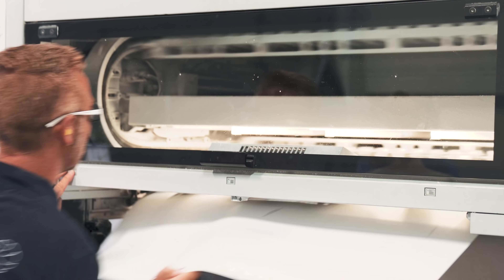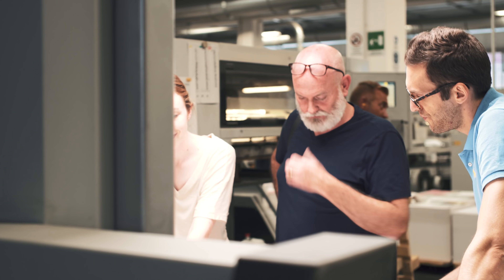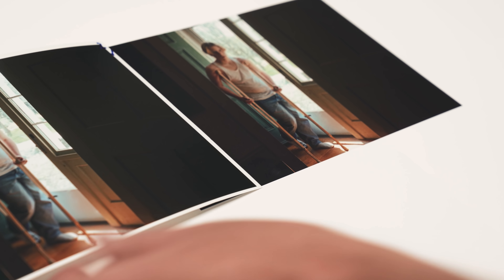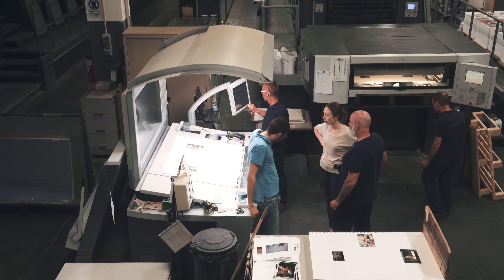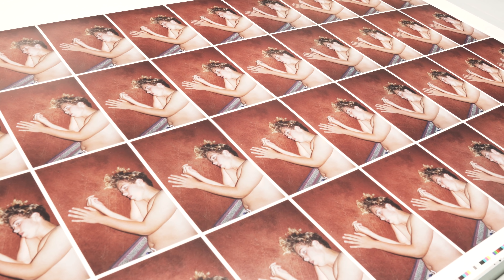When printing, every sheet needs to be approved by the publisher, since the inks fluctuate and temperature changes affect the colour balance. What they do is warm up the machine and run three sheets through, then pull one out and check the colour balance. They might say it's too magenta or the density is wrong, then make tweaks based on each individual image and run a few more until it's exactly how they want it. At that stage it gets approved and they print the whole run. This has to happen for each sheet or section of the book.